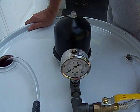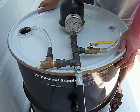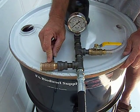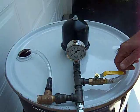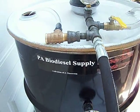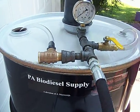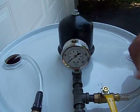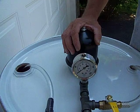If you watch this video, you can write down every part you need and gather it at Home Depot or Lowe's — though Lowe's has crappy pressure gauges and pressure relief valves, I wouldn't waste my money on those. This unit will do everything you need — whether you're processing WVO, cleaning WVO, or running your biodiesel through it. Any centrifuge you have, the only difference is going to be right here on the connection part. Everything else is good for whatever you're running. If you have any questions, please feel free to call us. That's what we're here for. Thank you.